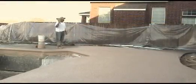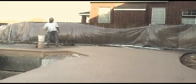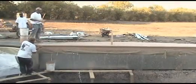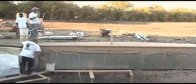After a section of the deck is covered, the dashman may want to even out the texture or raise the pattern a little higher. This is done by redashing a slight amount of material onto the work before it loses its water glaze. Remember that the object of this is to perfect the pattern, not to add more material.